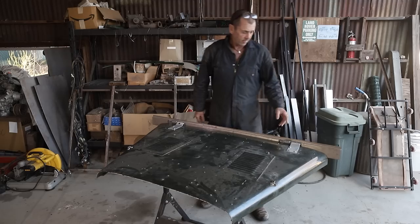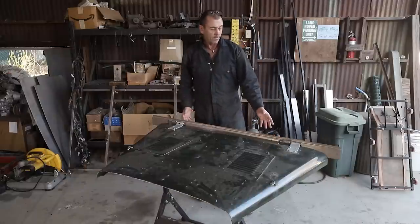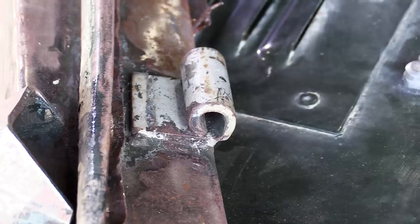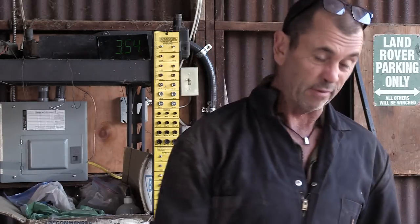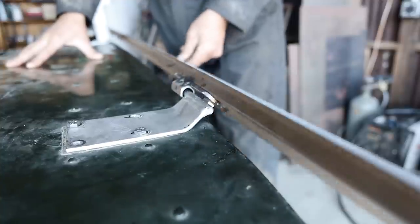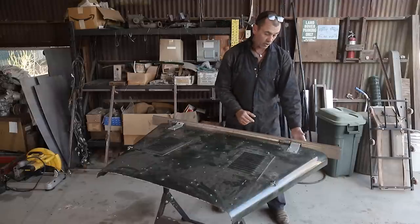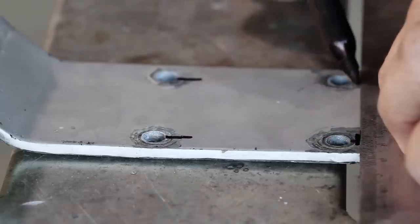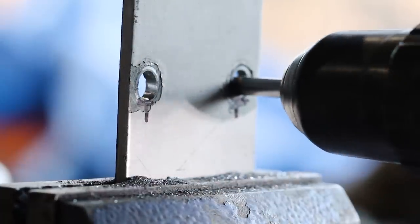There we have it — works. The hinges are where they need to be. There's our little bolt head — it just fits into that gap right there. But there were some variations on the original hinges in that the passenger side jutted out a little further than the driver's side. Because these are the same on both sides, we've lost a bit of that distance on one. You can see it clashes against the steel with its clearance on this side. We're going to try and elongate the holes of this bracket — draw a line down the guts perpendicular across, then take our milling tool and oblong those holes to make up some of that distance.